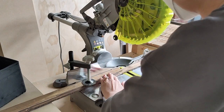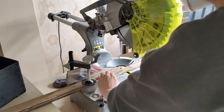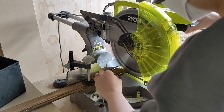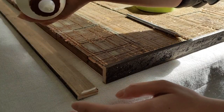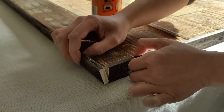Then we start framing. I made a video on how I created these frames from brand new wood to make it appear weathered and rustic — definitely watch that for a step-by-step guide. I cut the frames to size, then glued them together using a butt joint because that gives a more vintage look as opposed to a miter joint.